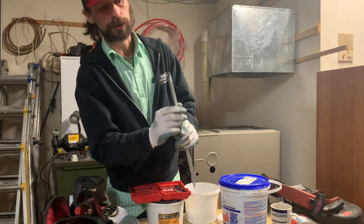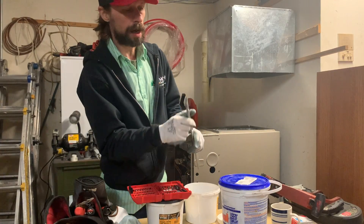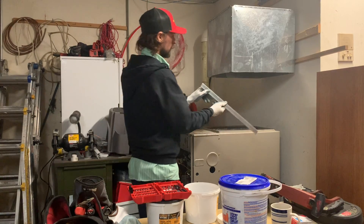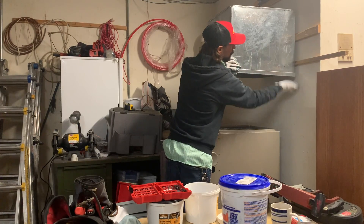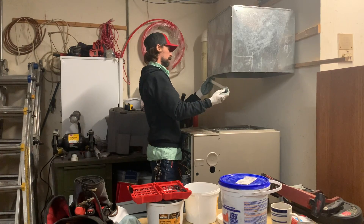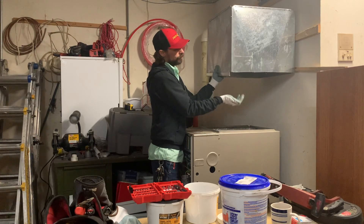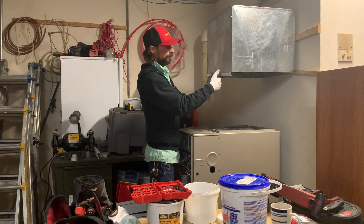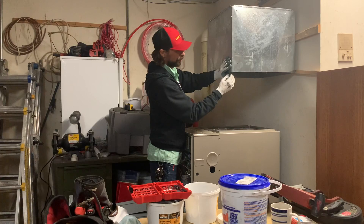If you look closely, these are formed like an S. What I always do is put the s-lock on the outside — these are going on the front and the back. By putting them on the outside, it makes it easier to slide metal in, as opposed to if they're on the inside where you can't work them into the one-inch gap.